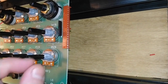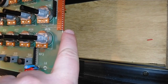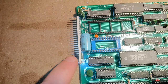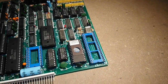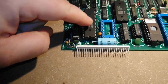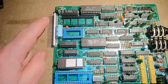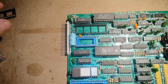Another notorious problem is these connectors here. Not only do they wiggle because they're not mounted properly — so the little legs underneath don't get a good hold on the circuit board — they're also bad quality and tend to oxidize. That doesn't mean you need to replace them though, because the connector on the other side is difficult to replace, so first try to clean them. You can also have a problem with this chip here, and that's usually because the socket has gone bad — the black sockets used are bad quality. It's usually only a problem for the big chip, however, so I decided to replace that connector and also replace the big socket with a nice high-quality one.